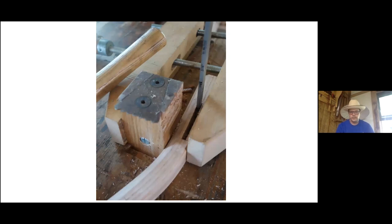This is how I chop mortises — referenced from the face of the flat on those octagonal posts. I try to cut the mortises while they're still octagonal because I have a nice flat surface to rest on the bench. It's just a typical mortise.